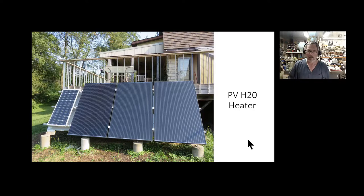Even though the system does an excellent job heating, my heating element and water heater is at the top so I'm getting a lot of hot water at the top, but I really want the whole 80 gallons to be 140 to 150 degrees. That's why I just mounted the PV panels on this existing structure. When I went to pick up the extra panels, there was some discontinued racking left over. I got it as high as I could to create as big an airspace as possible for the heat, and I still had to address the heat issue. I think it's important to try to keep your collectors as cool as possible.